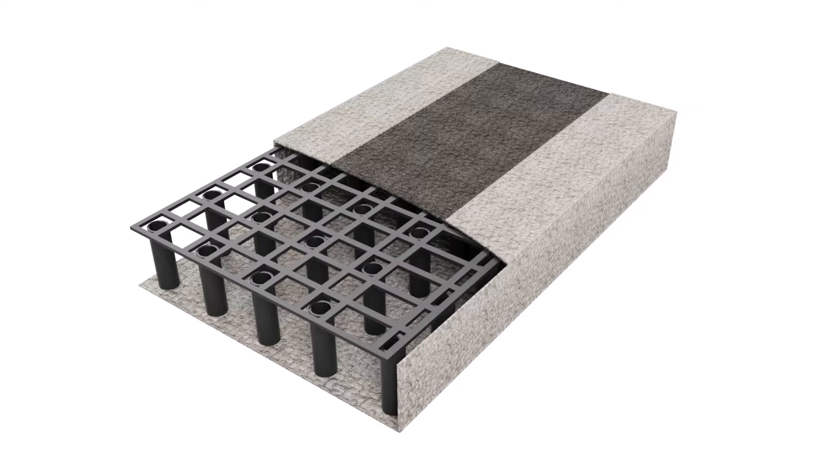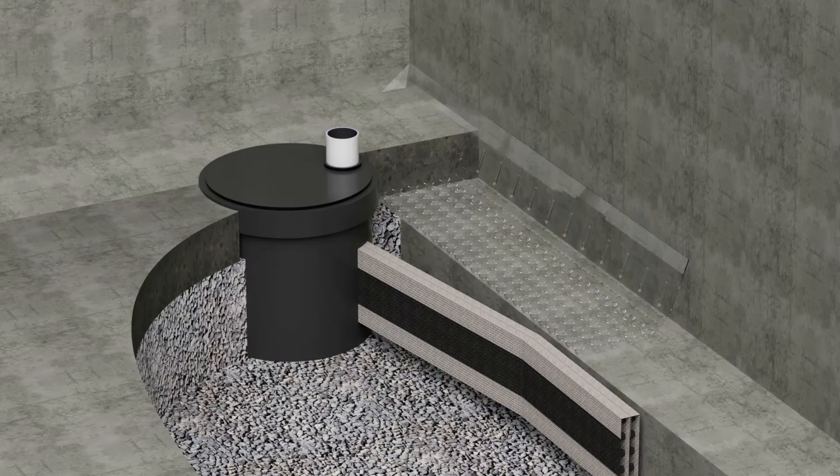With our system, we relieve it with a lot of open area, allowing that pressure to push up against it. You can do it with aggregate or without aggregate — one will relieve it a little faster than the other. That's what the contractor should be explaining to the homeowner, or what the DIY person should understand: you're trying to relieve that pressure. It's going to keep reoccurring — it's an over and over thing. You can't remove the soils; the soils will keep expanding and contracting as the seasons change and water is introduced.